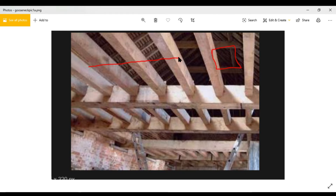To get the measurement for the overbent 90 or gooseneck, you measure from the top of where the pipe is resting — really the bottom of the pipe — down to where you want to enter your junction box. That's basically it: from the top of the ceiling to where you're coming into on the box. Measure that distance and that's where you'll mark Point A.